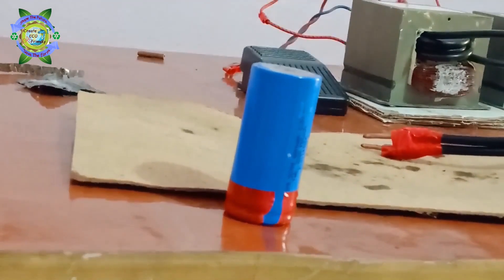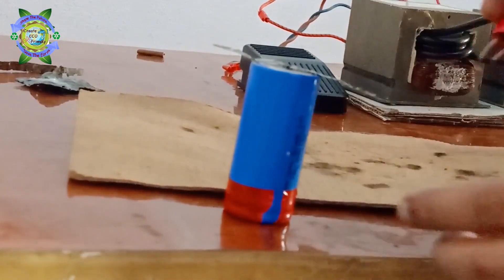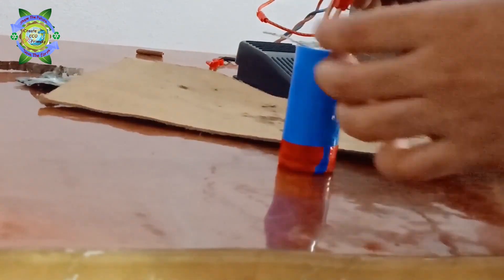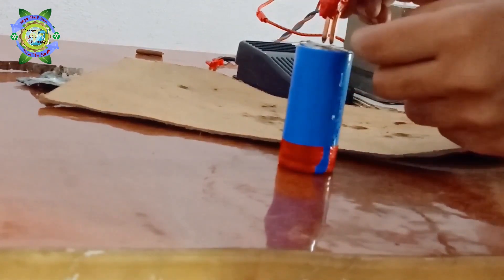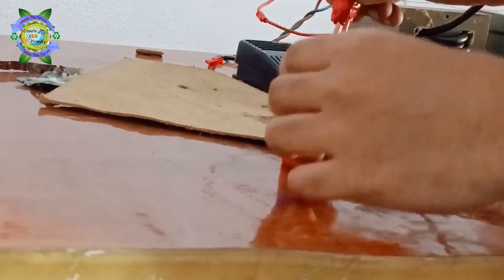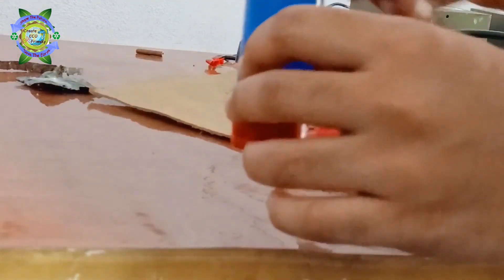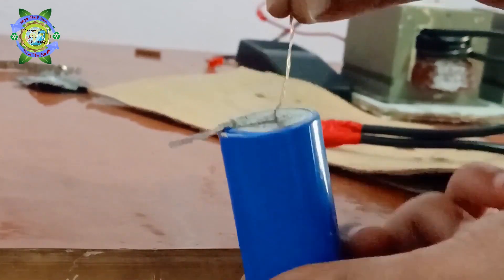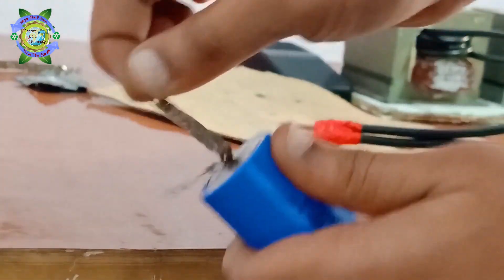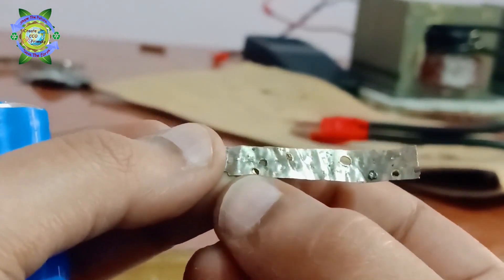Let's test on the real test subject — that is my battery. One spot, two spot, and three spot. You can see it's holding quite good. Let me apply some more force. You can see that the nickel strip just gets broken when removing it. So this test case is a success and I am going to use it in my next videos for spot welding for my DIY battery packs.